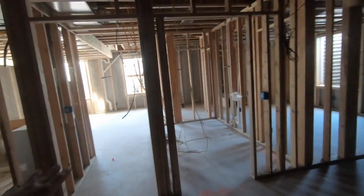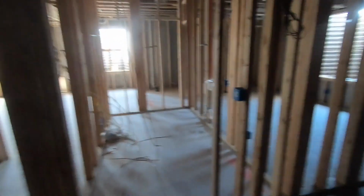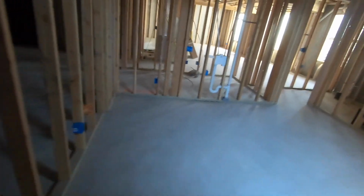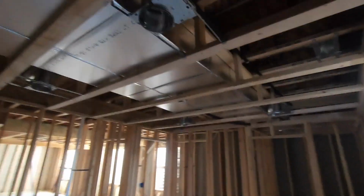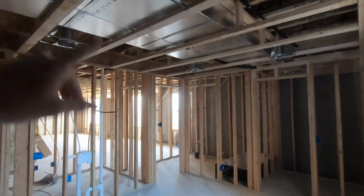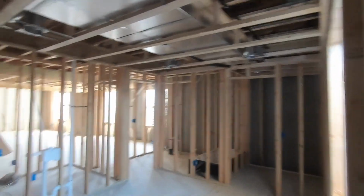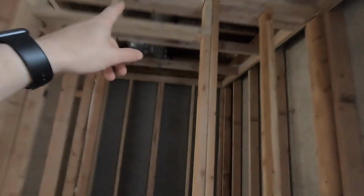But so the other half, off of the family room, we have the gym that's right here, the laundry room, and then another bedroom. So I guess we'll start in the bedroom. The bedroom has like a little niche opening so that it doesn't feel like it's right off of the family room. And then you have this. Again, I would typically only want to put two can lights and a fan in here, but because of the furr down and where the ducting's at, I had to do 4 lights to balance it. And then you have a light in the closet.